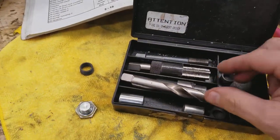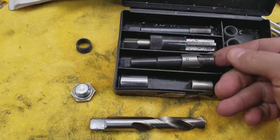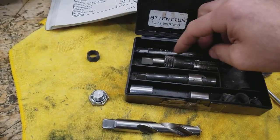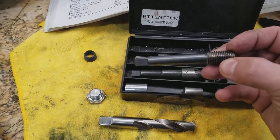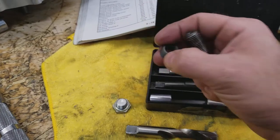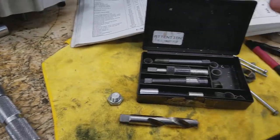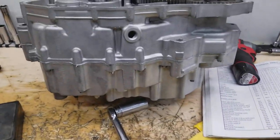There are a few different tools here. Basically you drill, and then you use this tool to counter-bore for this outer ridge, and of course tap. They have a tap guide that goes with that. Then this is a final set for the insert that basically spreads the final thread — the final thread is not fully machined on these — so this spreads that final thread and locks it in. That's how I repair them and recommend repairing them for a lifelong repair.